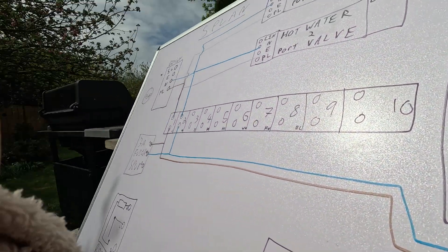Now it's onto the control. We're talking control — we're talking time, which is what the programmer does. We're talking thermostats and temperature. With lights you have like a photocell — that would be control of the level of light — or it could be a PIR, where heat passes over a grid and if it crosses a threshold it kicks in as a movement trigger. But for this system it's going to be a programmer which controls the time, deciding when you want your hot water and heating to come on during certain times.